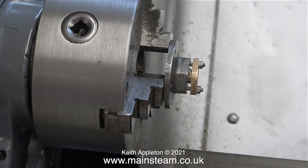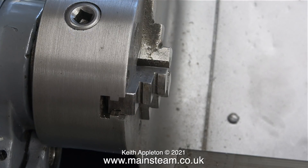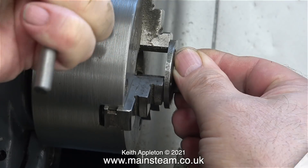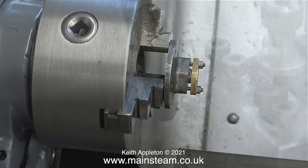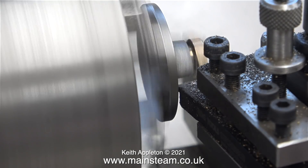The opening sequence shows the top cylinder cover held by the register — the part that goes down into the cylinder — a very small protrusion on the underside. It's currently fitted into the chuck of my small Myford lathe. Because the ends of the jaws are square, unlike on my larger lathes where the chuck jaw ends are all chamfered, there's not much metal being held by the jaws, and for that reason I'm taking very fine cuts.